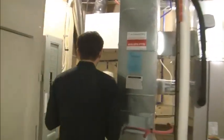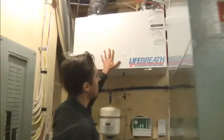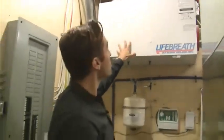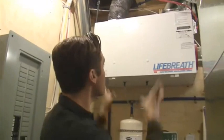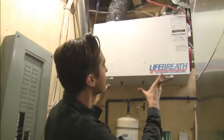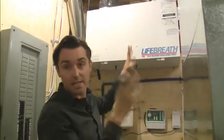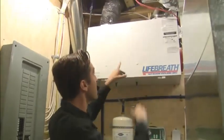So follow me around here — this is the HRV right here. It's this big white box, about three feet long and about a foot and a half tall. As you'll notice, it is mounted close towards the ceiling, and the reason for that is the HRV has to connect directly to the outside through some air intake and outtake vents. Because we're in the basement, it needs to be up high to reach the exterior.